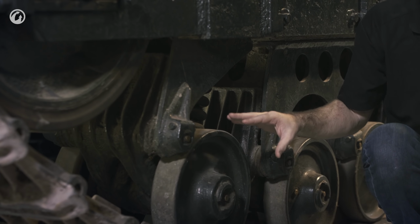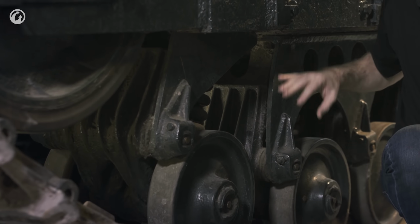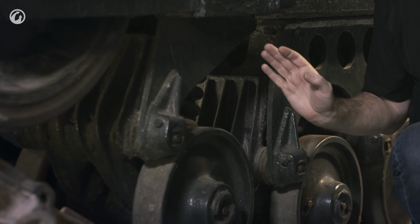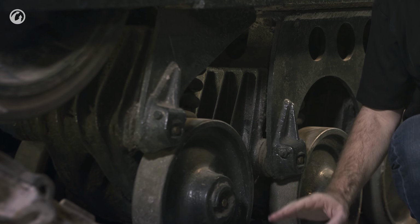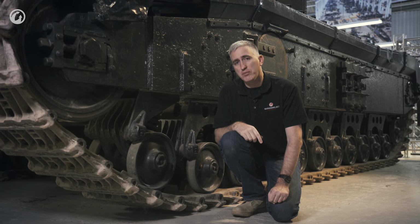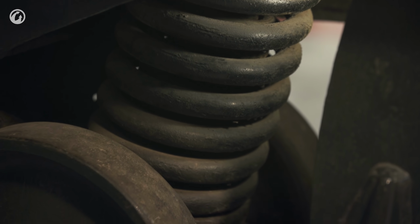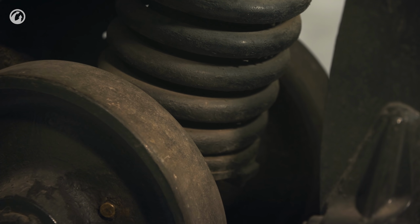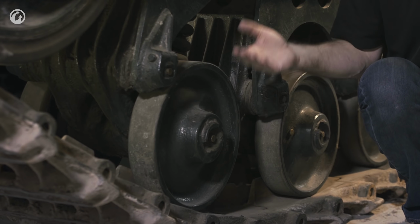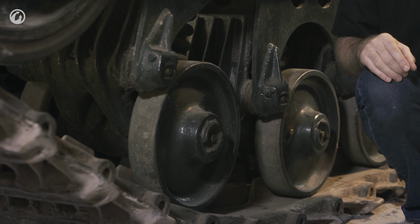Come down to the rolling gear and you will see the Churchill-derived suspension, although you will also note that they've added heavy-duty brackets to mount the wheels in pairs. The metal wheels, 14 inches, are running on metal track. Combine that with the track skid return, and this is not a tank for sneaking up on people with. The coils, well, there's actually 3 of them, all concentric. An outer coil, an inner coil, and then a central core coil. And depending on the level of deflection, the different coils will likely take different levels of the weight.